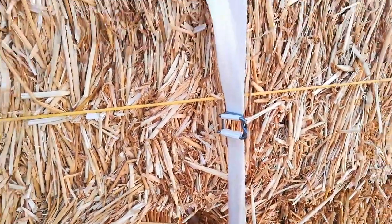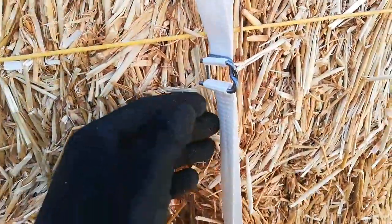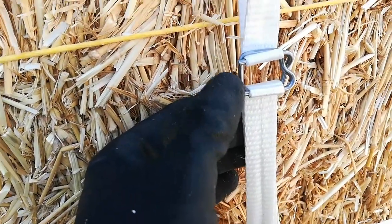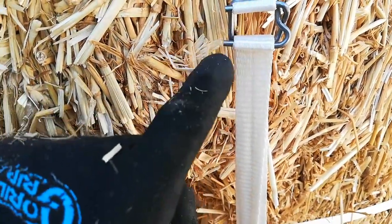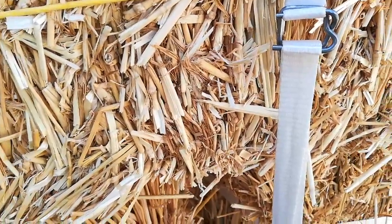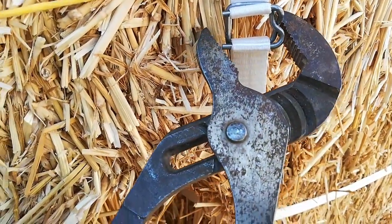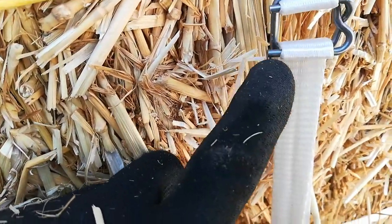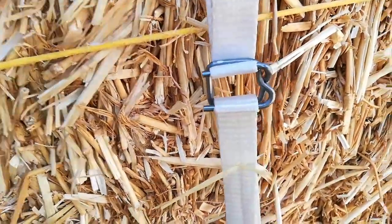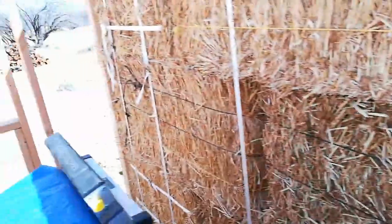We're in the process of tightening the straps down, and here's one of the things we learned right away. As this gets under extreme tension, this buckle may slip down — this bottom portion could possibly bend down, releasing the strap. It happened to us once. So what I'm doing is tightening it and going in with my channel locks and squeezing the buckle to make sure that it's always peeking out from the loop on both sides. That's allowing us to get some really good tension on it — really as tight as a drum.